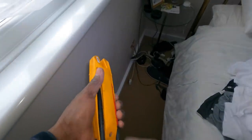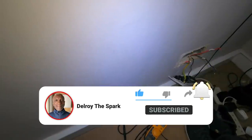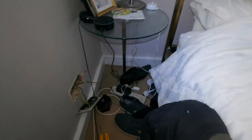That's not working. Nope, that's not working. I expect that one not to be working also. Nope. That's working. So out of one, two, three, four, five, six, we've got one working so far. One of these legs should be live. All right, so that's the live pair — not that, not that, so we've got that one. That tells me it comes from the fuse board over to there, then to here, and continues the ring round, then back to the board. So I'm going to reconnect this.